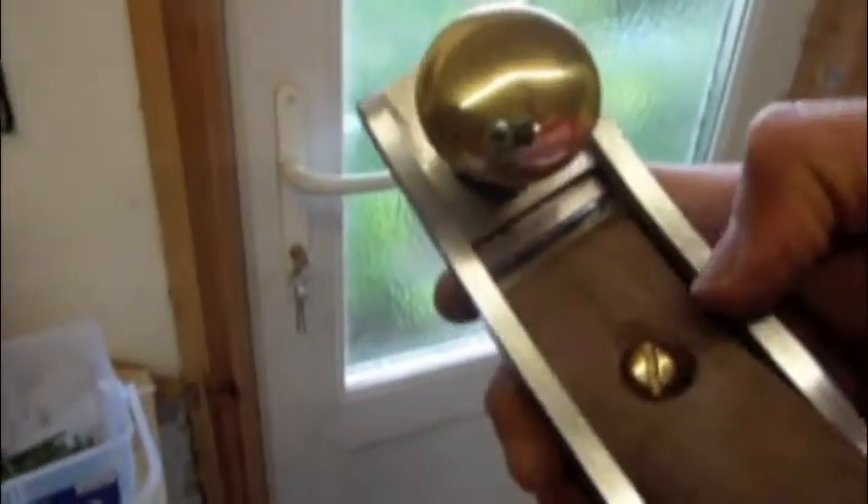The finish, as you can see, is still a little rough but it's getting to be a mirror. I've got a few little bits to deal with because this walnut can get quite smooth, so I somehow need to make it grip the blade a bit more. It might even be a case of having two pieces down the sides of the blade just so it can't move side to side, because once you go square it's square — that's where it stays — and as long as you sharpen it square every time, it'll all be fine.